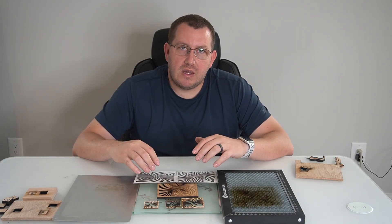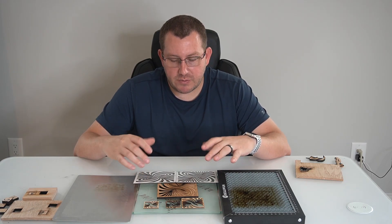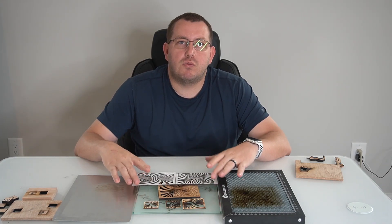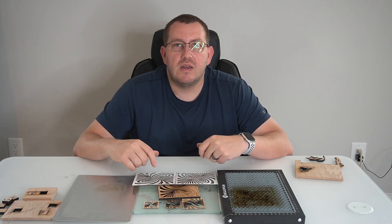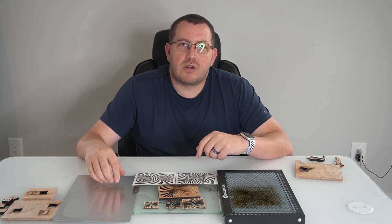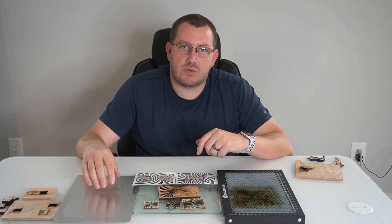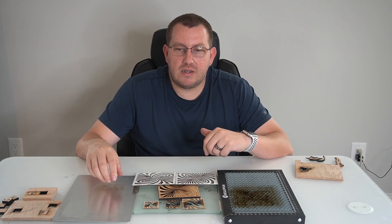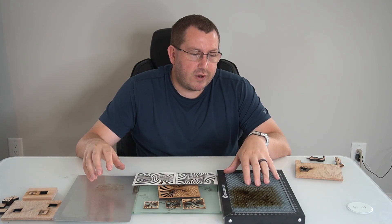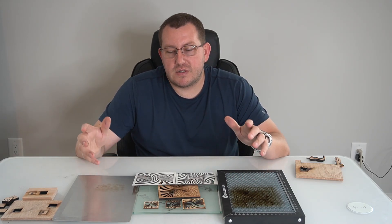Alright, so that covers the examples. When dealing with wood or similar materials, the mesh made a big difference because it allows air to get underneath, so it wasn't burning the bottom. Some materials like thicker cardstock didn't really make much of a difference. It really comes down to what you're planning on doing with your laser. If you're focusing just on engraving, an aluminum base is fine, or you can even use some scrap wood underneath as a precaution. But if you are doing any real cutting, the mesh system is pretty nice and wasn't expensive — about $30. The size is a little weird since it's meant for standalone laser engravers, but you can make it work.